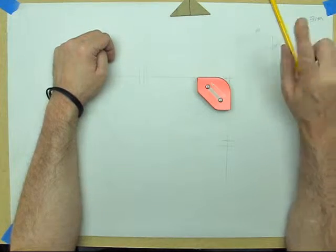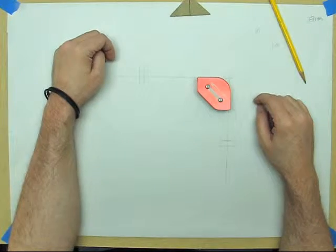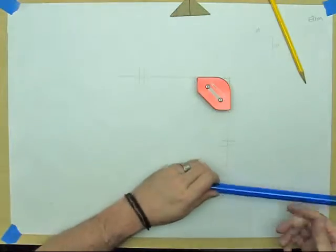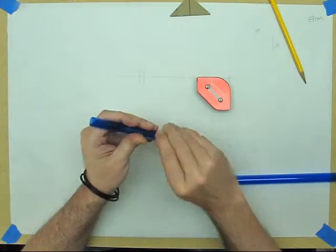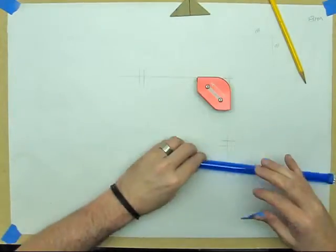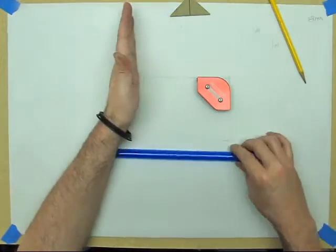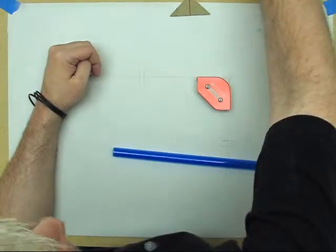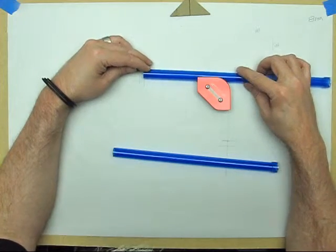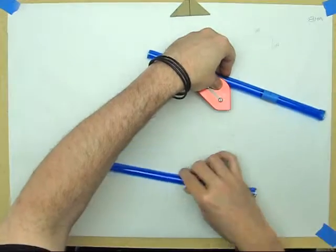I'm going to go bend a piece of tube real quick, and when I come back I'll show you how it fits in there, and the next stage of this process, which will be marking off the tube length for cutting. And again, I'm going to borrow a piece of tape off of this other. The other nice thing is when I'm going through my scrap bin, because I've got my marks laid out now, I'm able to dig through my scrap bin and find pieces of tube, lay it in there, and then carefully do a little sort of test bend.